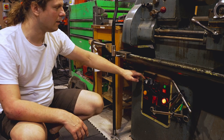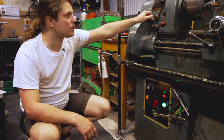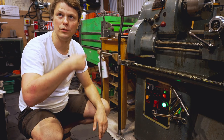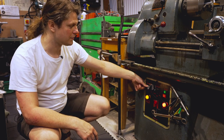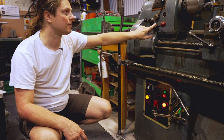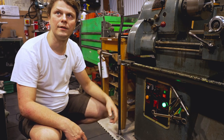That switch here is the reverse. By default the machine is locked — it won't go to reverse until you explicitly enable it. So the reverse switch on the main switch does nothing; the chuck would rotate the same direction no matter what. The chuck should always be rotating towards you when you're cutting things. If you hold that switch for a few seconds it would go into reverse mode and stay there, and now the reverse switch is operational. In order to stop it, just restart the switching — if you just flick it shortly, nothing would happen.